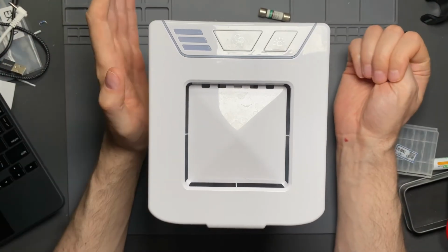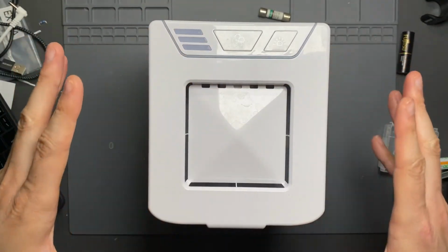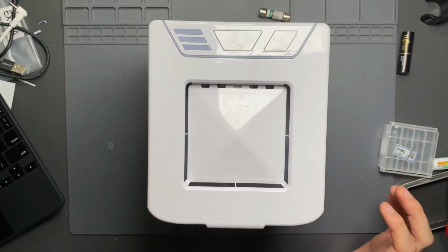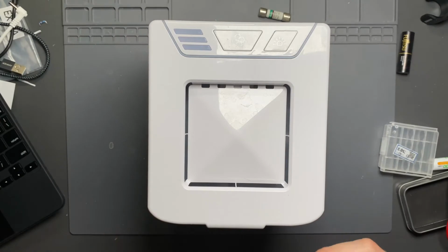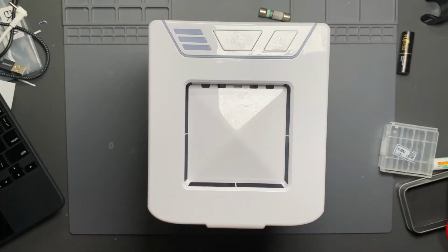If you're in an area with high relative humidity and you think you're going to get 3 or 4 of these and your air conditioner has stopped working, you're not going to meet your expectations. It's just not going to be able to keep up. Not only keep up with the heating load, that's what the BTU per hour cooling power, so to speak, is, but also you need to get rid of that humidity in some fashion.